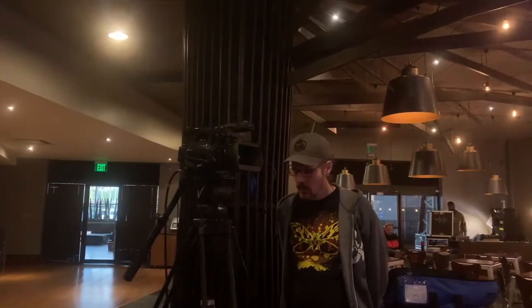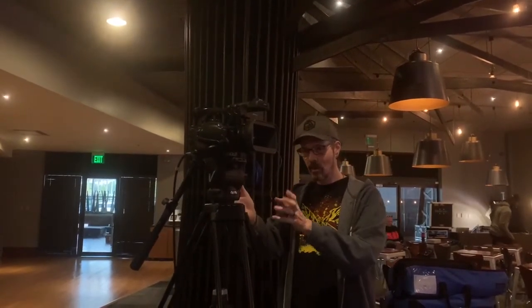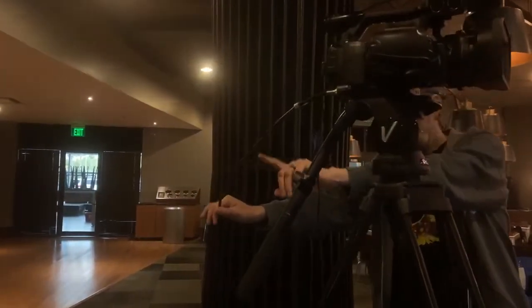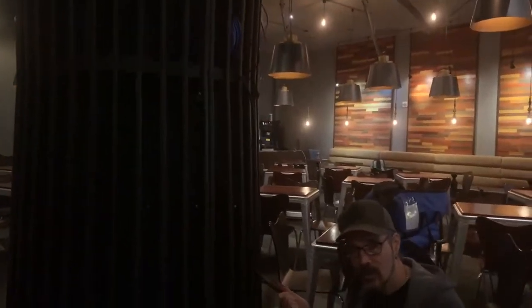Okay, now let's talk quickly about setting up some cameras in here. Real simple. You guys know how the tripods go, you know how the cameras fit on them, and you know how to get them all balanced and everything. All that still applies here when you're in the Treehouse, just like it did when you were running PP2. So get everything set up in there, and then the actual signal flow, we're coming out of the back of our camera with our SDI line, and that is running into a dedicated line here on the tree, and the other end of this is going to front of house. So this one's always in place, all right?